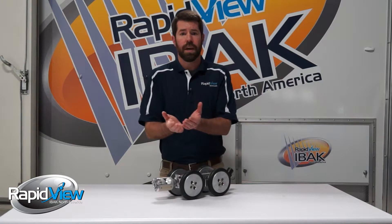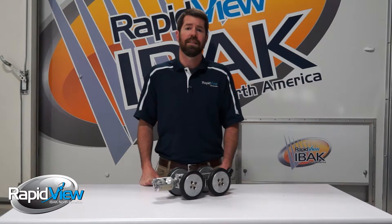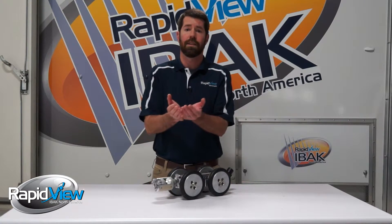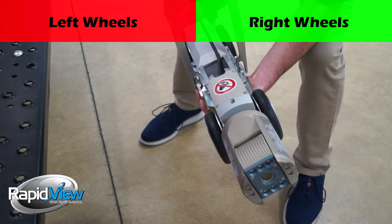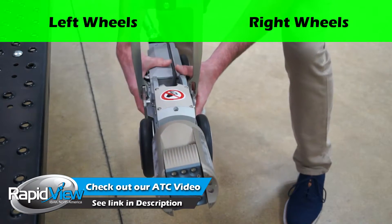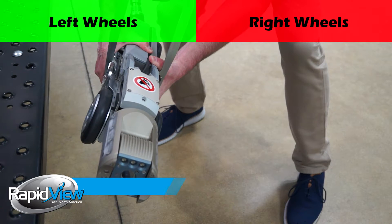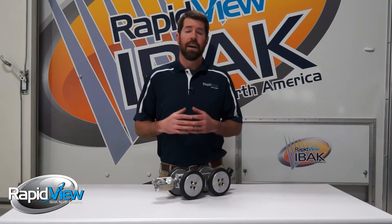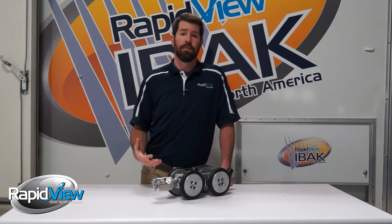It's common for tractors to go up one side of the pipe wall versus the other. The T66 comes standard with built-in sensors that sense when the tractor gets more than 15 degrees up one side of the pipe wall. When that happens, the inside drive wheels turn off, and those outside drive wheels force the tractor back into the center of the pipe. This cuts down on a lot of those everyday tip overs, which at the end of the day saves you time and money.